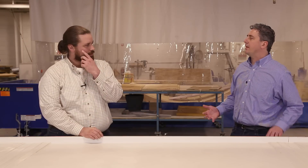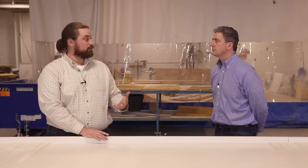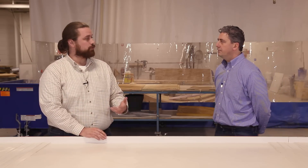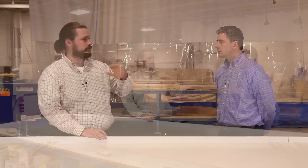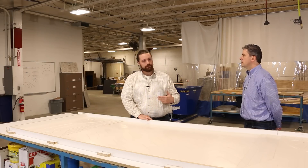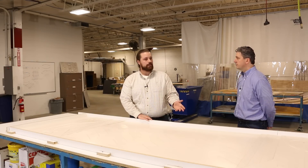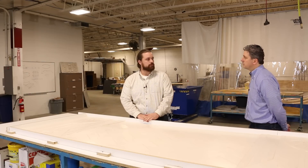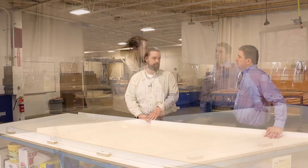So if you could tell us a little bit about the inspiration and how you came up with this idea. Sure - we're trying to make something structural and we're going to use GFRC for that. GFRC typically is not used for anything structural; it's usually used as a facade or maybe as a countertop. But in this case we wanted to create an application for it that would be a little different. We could talk about the design of the panel itself and the mold making and casting.